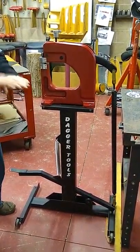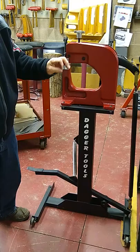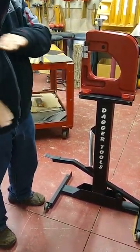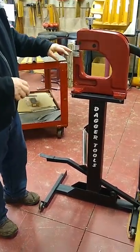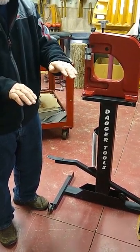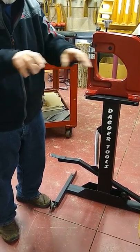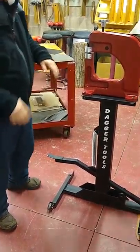The nice feature of the quick-release or short-stroke design is that I can set and bump the machine and get the same amount of force across an entire surface edge. I'm not pushing more force here and less force there as I get tired. This gives a much more balanced approach. Historically, with mechanical shrinking, one of the real goals is to get more activations and contacts across a larger surface area, so you get a much more uniform flow of the shrinking or stretching process.